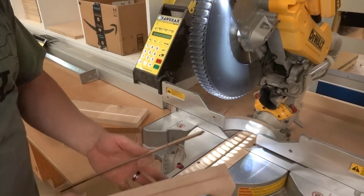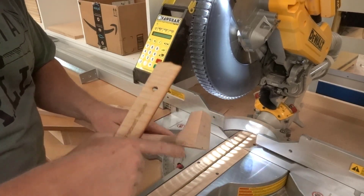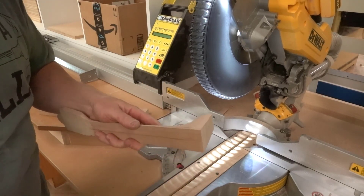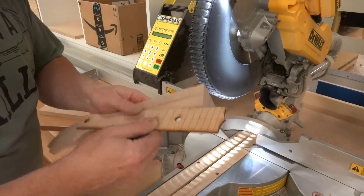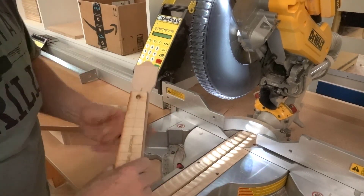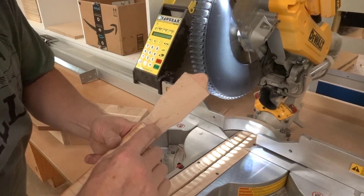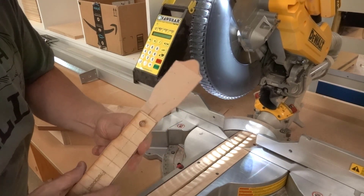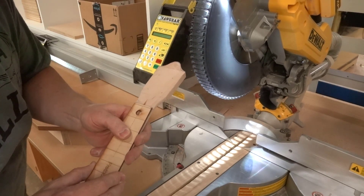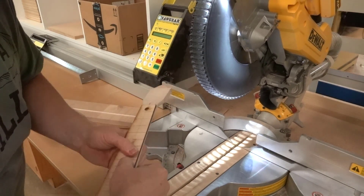Next step — I just have this over at the chop saw — we need to figure out where to cut this end part off for length. It's got to be a little bit shorter; we made it oversized. So we take this same template we used earlier to cut out the width, put it back on exactly where you had it. That little transition line I put on is barely there, and it lines up with the edge right where you had it before. That's critical. Nice and centered.